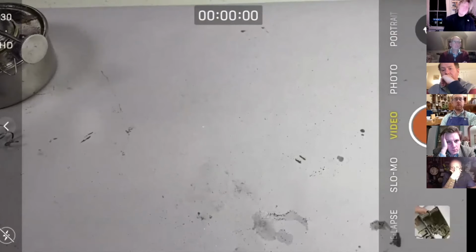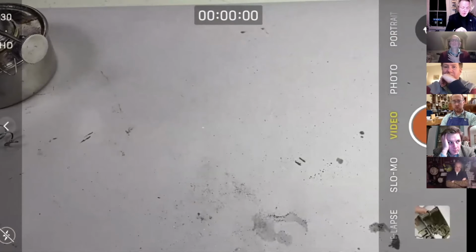Okay, so I've actually soldered it back on about 1/4 of a millimeter further out, so not further in, sorry, so there's less internal drop. Now we know last time that was right on the limit anyway. So what I can do, because I'd left a bit at the end, I can either leave it like that and stone or diamond stone it back.